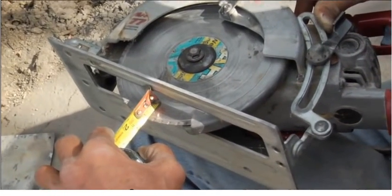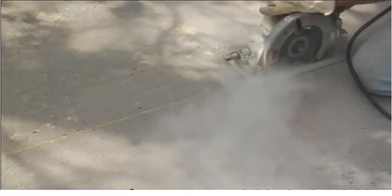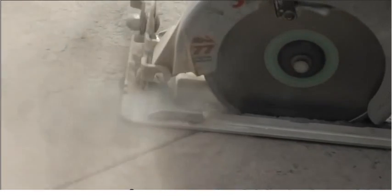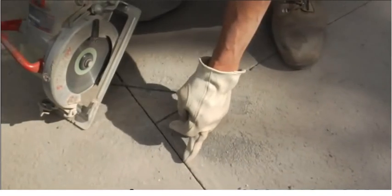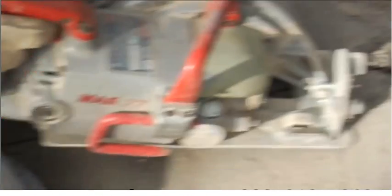Set the diamond blade depth to one inch and make your cuts. You can use the saw motor's fan to blow off the dust to see the line better. Start your corner cuts with the blade centered over the slot. Make an extra cut by the leadoff slot that goes to the edge of the road for the wire return. Set the blade to full depth for where the slot runs off the road and cut the last few inches deeper.